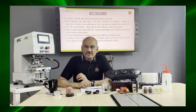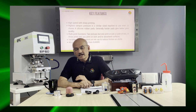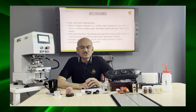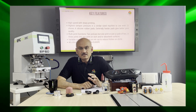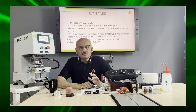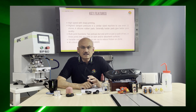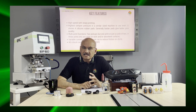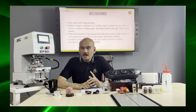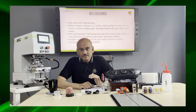The machines are very high quality in terms of speed and sharpness of printing. This is due to a special feature that is the highlight of an Epic machine — it has one of the highest pressures among similar-sized machines in the entire world. You can even use a very hard pad like a 22 Shore A silicon rubber pad. The harder the pad, the better the print quality.